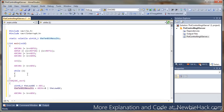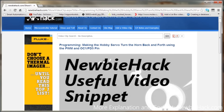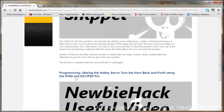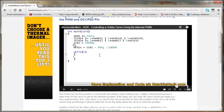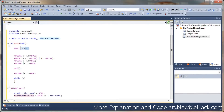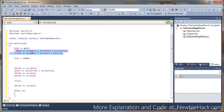Now we need to know what code we need for the servo. Let's go back to the NewbieHack site and search 'programming, Copy Servo PWM OCR.' This one looks like a pretty good one. The video clip shows the code we need, so I'm going to copy that into the program line by line. Port D is going to have the OCR pin and it needs to be set to output. I'm also using the 16-bit version of the PWM, and this sets the top end of the PWM timing.